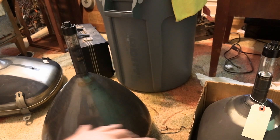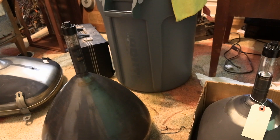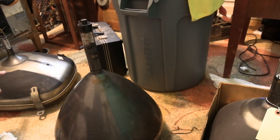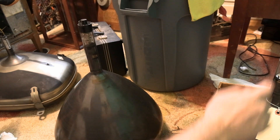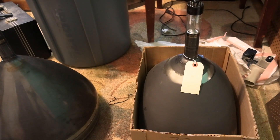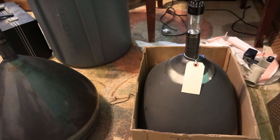One topic is the coating that some picture tubes have — they don't all have it. This one does on the outside. That is a conductive graphite coating that gets grounded. It's not for shielding exactly; it works in conjunction with the internal coating.